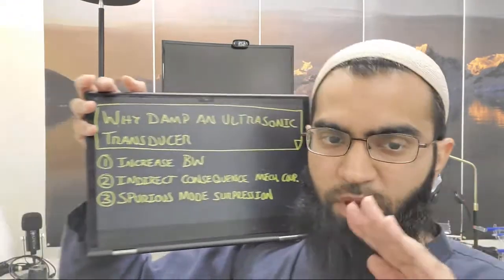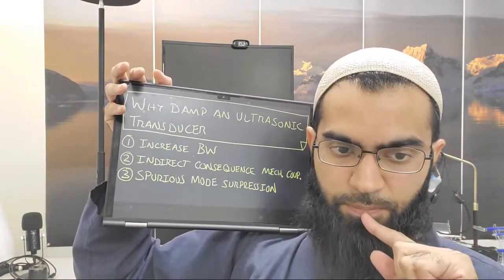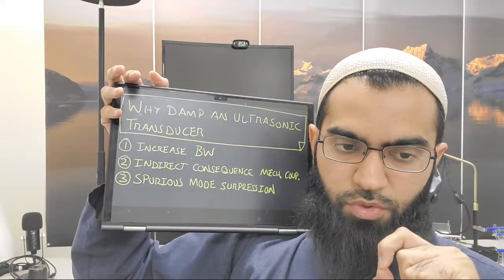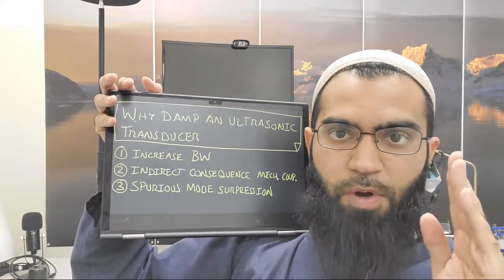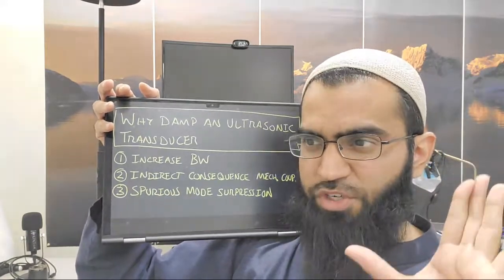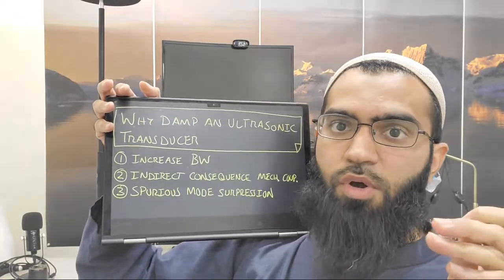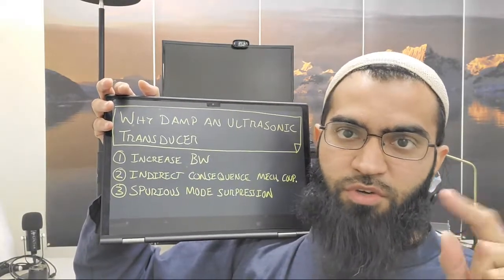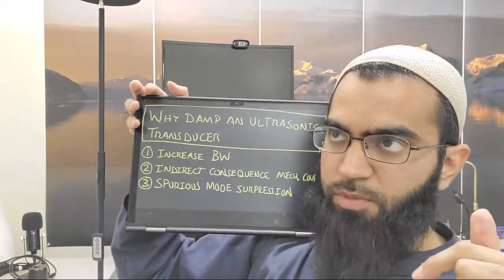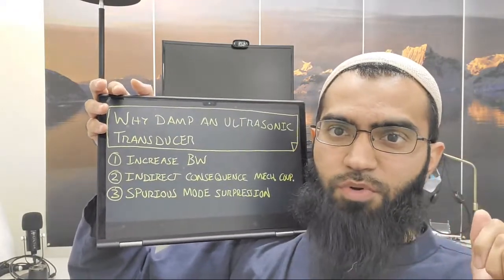And wherever else you may find oscillation that you detect is a spurious mode, either maybe perhaps in FEA you could predict what the spurious mode is, or you can just provide a more general damping, because a lot of times spurious modes are high Q, because they only oscillate in a certain portion of your transducer. That typically doesn't involve, sometimes it doesn't involve interfaces, but basically a small amount of damping can actually reduce the spurious modes.